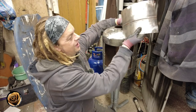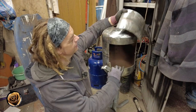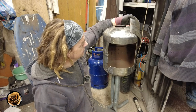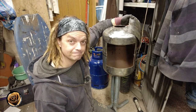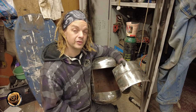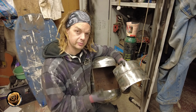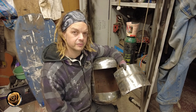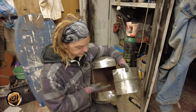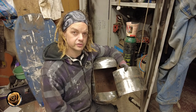We've got the body, the door, the handle, and the hinge — all we need now is a chimney for the top. On the one I made previously I drilled holes at the bottom to let air through, but ash started jumping out through the holes onto the patio, which isn't ideal. So this time I'm changing the design: I'll put holes in the front of the door, about a third of the way up the burner. That way nothing jumps out but you still get good airflow to keep it burning even when the door is shut.